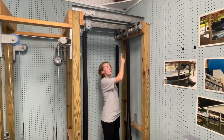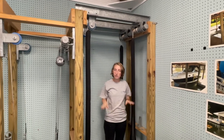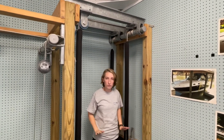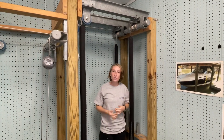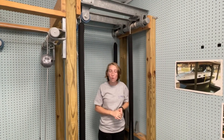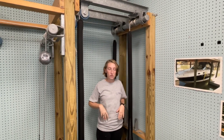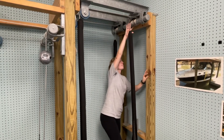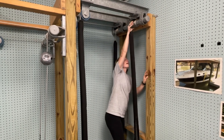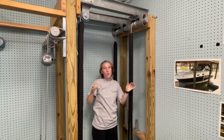Your cable is spreading apart. A couple of causes for this: when you lower your lift, it's hitting the bottom and getting unsettled, which causes the cables to separate. If you're in an area where you get a lot of wakes while boating, that can also cause separation. The best way to fix this is to get the boat off to reduce the weight, then take a hammer and just pat, pat, pat — it will push back together.